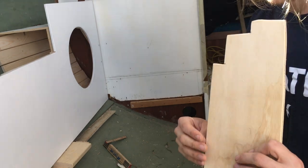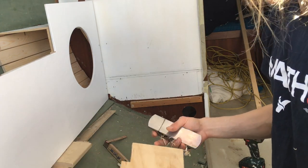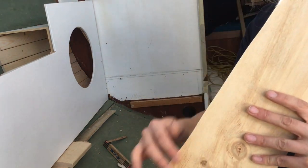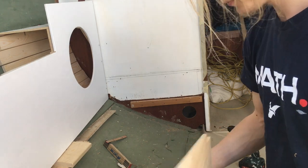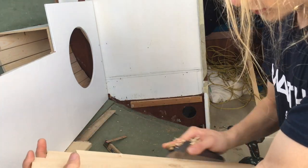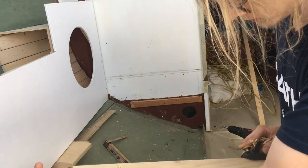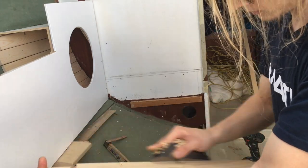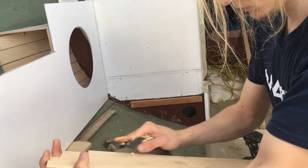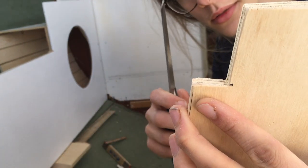What I've found is that it's advantageous to make a bevel on the bottom to make it easier to get it in. So I find out which side is the top and bevel the underside, which really helps it get in that last bit of the way — just with the plane, giving it a steep 45-degree angle on the inside. And for the smaller portions where you can't get a plane in, I just do it with a chisel, because nobody's going to see that side anyway.